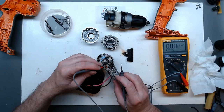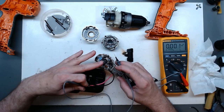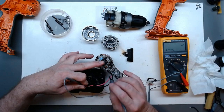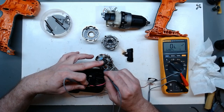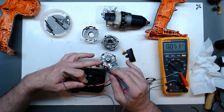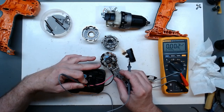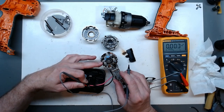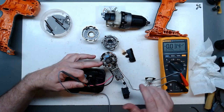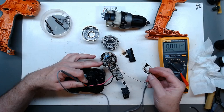I definitely have my 20 volts to the board. Staying on the 20 volts, going around — that resistor is good. It is actually hitting what I'm assuming is the MOSFET. So our power is getting there; it's going to be something on the control circuit. I don't see any major power component issues. One reason I was leaning towards control voltage anyway is I was not even getting my LED light to come on.